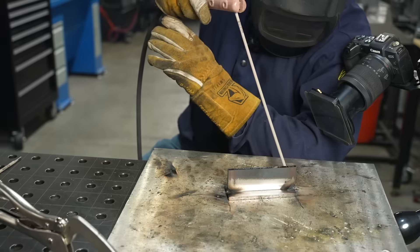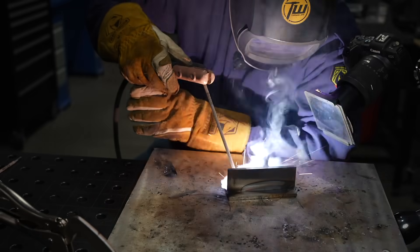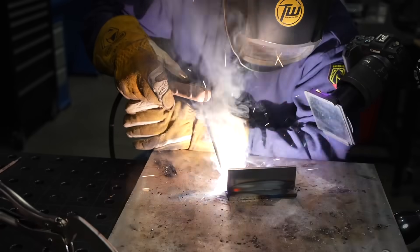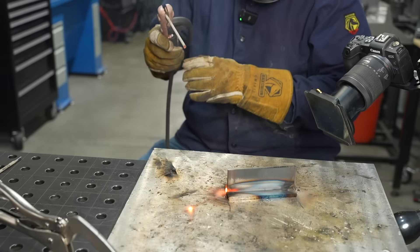Of all these rods, 7018 can be the most difficult to strike an arc with, especially when restarting an electrode, because the rod actually burns up into the flux and can get a little slag on the end. When you run it though, notice I can keep my arc length really short — even the flux bumps into the sides from time to time because the arc is burning up inside the flux. There's much less spatter than anything else. Notice how distinguished the bright weld puddle area is from the slag that follows behind it — really nice to run. At the end, watch as I finish the weld: I'm going to flick the rod when I'm done. Notice that little blob of slag that flew off the end — that's going to make it much easier to restart, so flick it off. That's a little tip for running 7018.